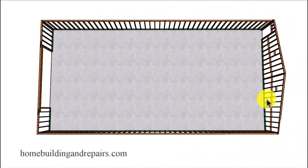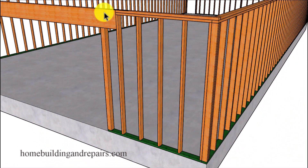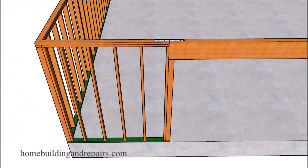Our building is 30 foot by 60 foot with a door over here and a large opening over here for our garage door. I'm also going to provide you with two different ways to frame the header here. I went ahead and used a 4x4 post — the 4x4 post was part of my original design thinking that I would need to install hold downs at each end. So I have a 4x4 here and a 4x4 here. You might need to add more anchor bolts and hold downs to provide additional lateral support for the front wall.